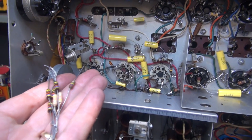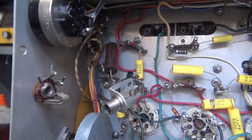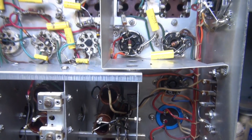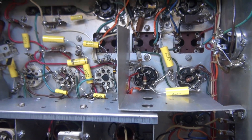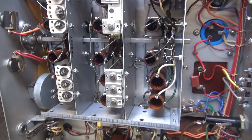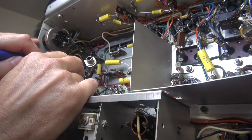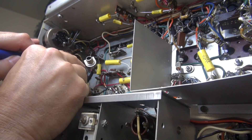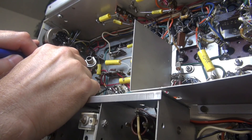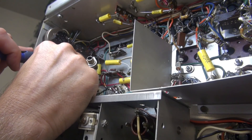I've gathered up some resistors. I'm going to start from the upper left, work my way across and down. We're going to change out all these 10% resistors, put in five percenters, verify the tubes, and fire it back up for a performance test. The resistor replacement process is very tedious, especially when you remove the leads from components and wire in the new resistor.